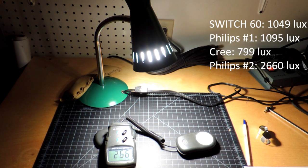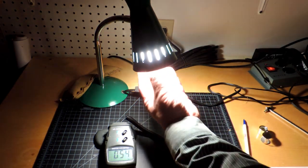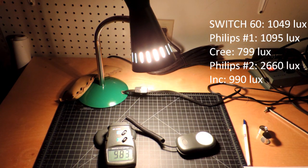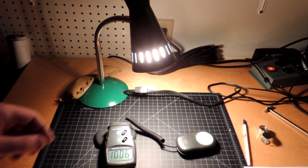So it's exactly opposite from the Cree. This is a wonderful light bulb, but I'm sure we'll find out that this light bulb is quite poor in other light fixtures. As a reference standard, this is the Philips incandescent light bulb, just a standard sub-$1 light bulb, riding at about 990 lux. So there we have it — almost a 3 to 4 to 1 difference in actual usable illumination from this light fixture, from what are all supposed to be the same bulbs. Let's try a different lamp to see if there's any difference between which bulb will excel and which will not.